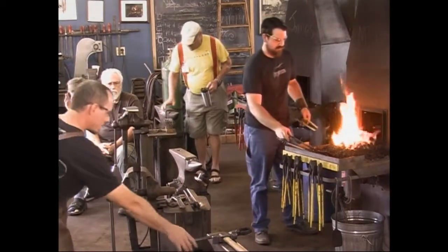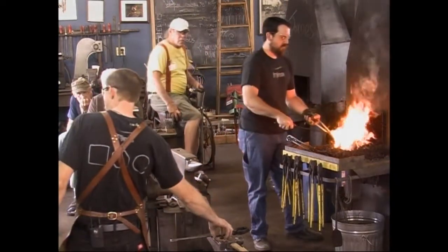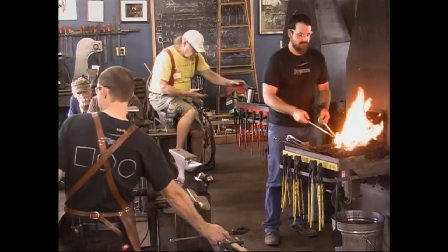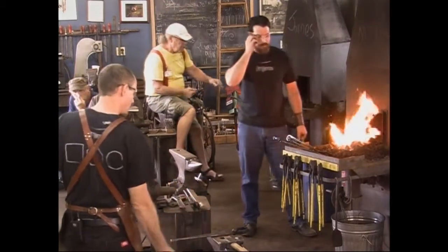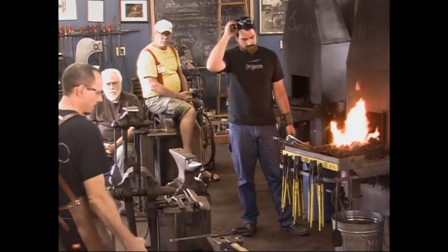Well, we have a 1-inch Hardy shank here we're dealing with, and that's what I want to produce. So above that, we've got a shoulder or a boss that'll rest on the anvil face. And so what I want is I'm going to leave about 1.5 inches square. So that's what I'm looking for, roughly 1.5 inches square here. And at that point in time, we'll butcher it so that we can then draw that shank, 1-inch shank down from there.